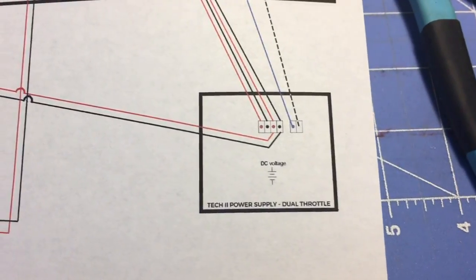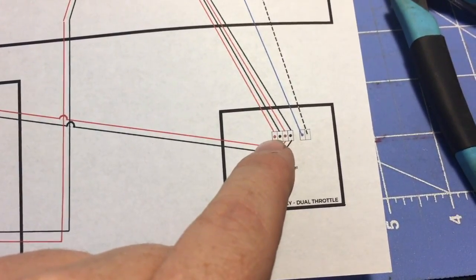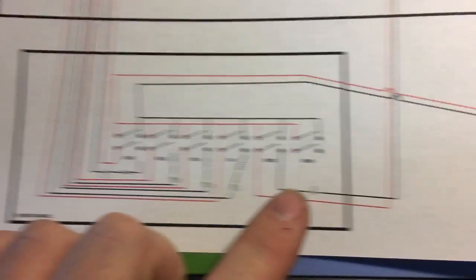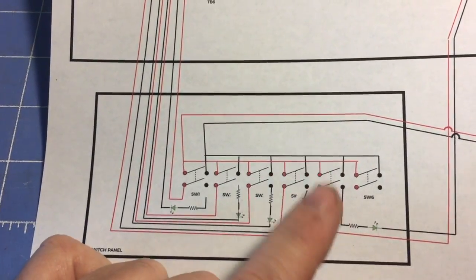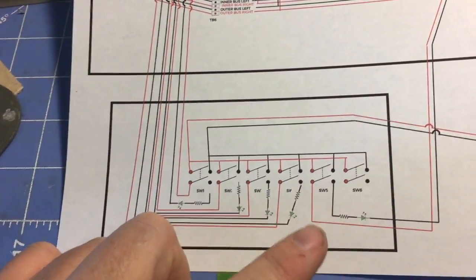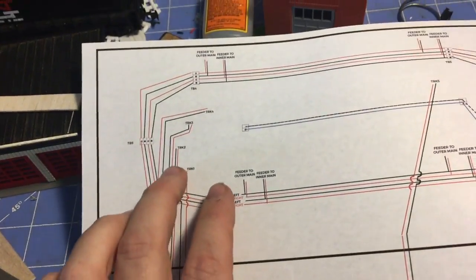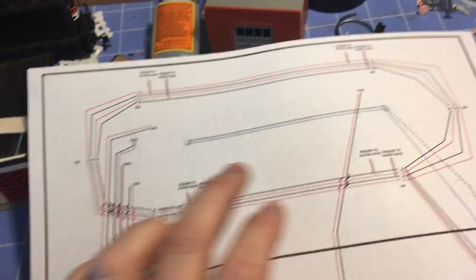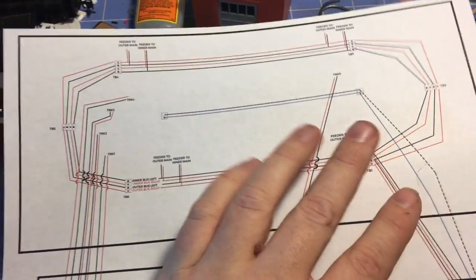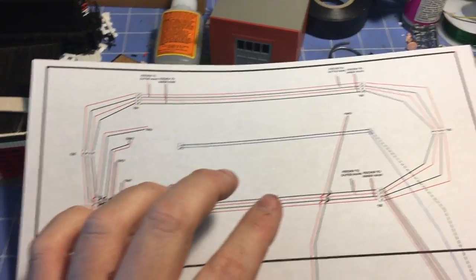The next big thing is the electrical for my layout. This is my MRC Tech 2 power supply, dual throttle — one set of terminals is for throttle one, one set of terminals is for throttle two. That's my AC bus. This is my switch panel; they're all going to get green diodes at some point to signify that the track is on — that's why the diodes are in line there. All those switches jump over my main bus to the direct tracks. This is my 4x8 layout; my AC bus just goes down the middle. The intent with that is that most of my buildings are in the middle, so I can just tie everything in without doing too much work.